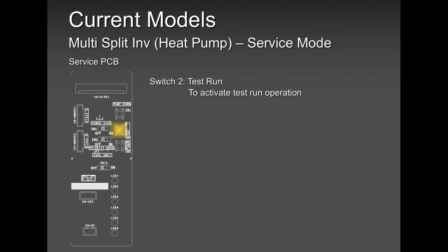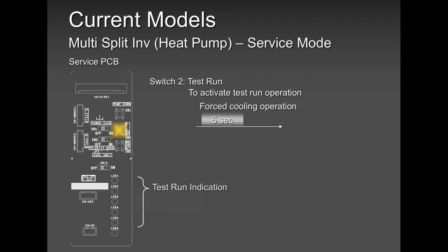And because you have a crosswire, the one unit that was not supposed to run is getting flow of refrigerant, and it's freezing. The coil is frozen. And F17 is going to show up. We'll talk about the error codes later, but that's how it is. So forced cooling and forced heating is good, but use it for testing, use it for troubleshooting purposes. Don't use it for commissioning.